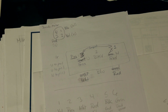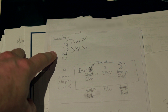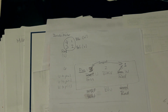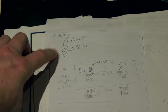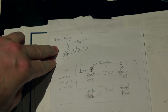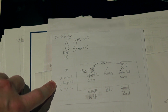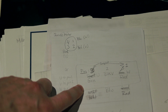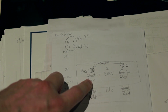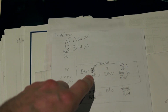I wanted to give a little more clarity to my spindle cable wiring — this is for the 4-pin connector. I popped the back off the motor to check which color wires were going where, and based on some pictures and stuff found online, I made assumptions as to which was the W, U, and V. I made a little diagram, came up with an alternate wiring possibility, and when I actually wired my connector, you can see which ones I crossed out as to how I was going to wire it. I swapped one and three because my spindle was spinning the opposite way.